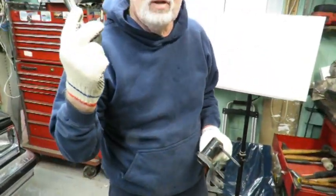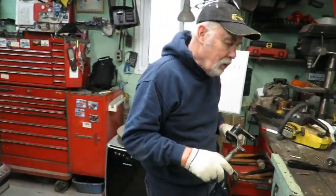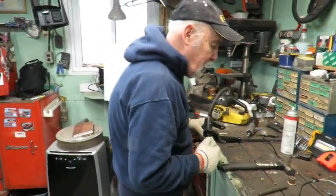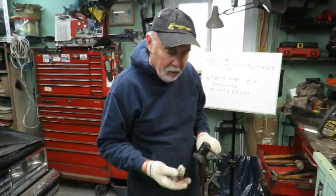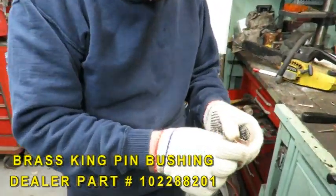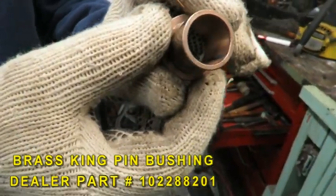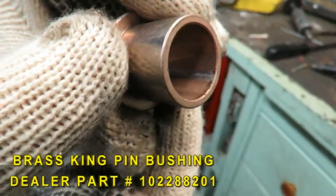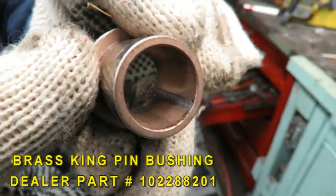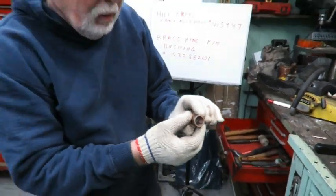Both of them are relatively cheap. For probably $25 a side you can get them going again. The thing I've noticed is some of these didn't have a bushing that actually has a groove in it — and you really need that groove to allow the grease to go through and properly lubricate it.